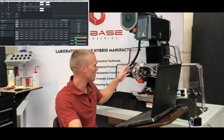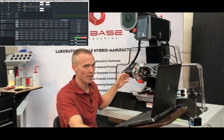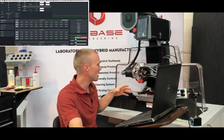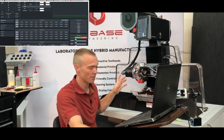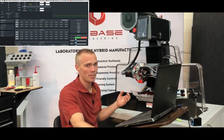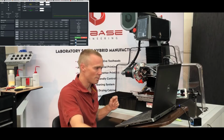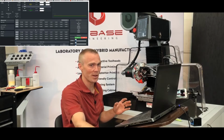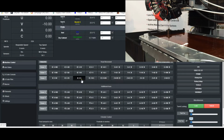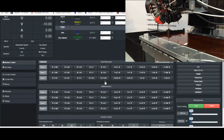And the same thing with your cutting tools. In general, you're going to knock a spindle out of tram and you're going to break your cutting tool, but you're not actually going to damage the machine itself. You might damage your print bed or a vise or the part that you're working on, but in general, the machine's fairly tolerant to crashes. So anyway, we do want to avoid crashes as best we can. So when you're jogging the machine, you want to use the smaller movement buttons most of the time. So I'm coming down toward my touch plate now, just above it.